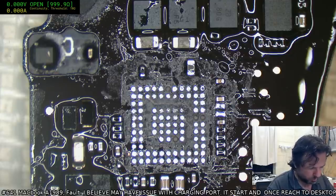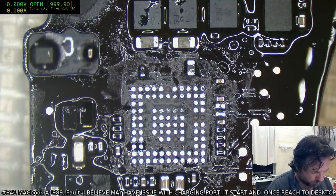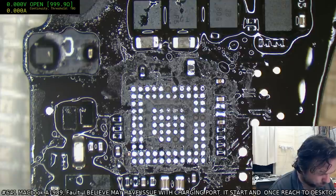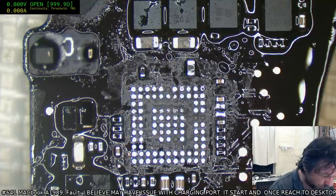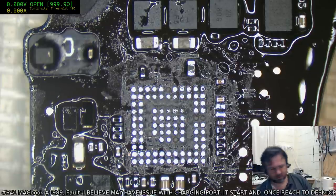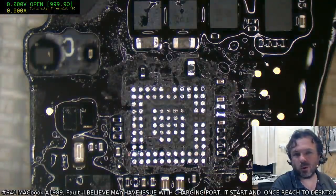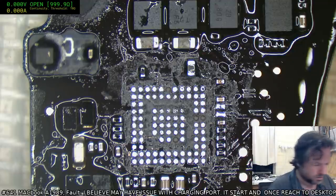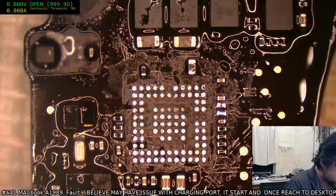That is one of the problems when it comes to working with these chips that all have to work for the board to come to life, is that you don't really know. By the time you get all the ones that are working together, you're not going to take them off and mark them as, okay, these ones are good. You're going to leave them on there. So there isn't really an easy way to test these things. I suppose what you could do is get a board that only has one. Are there any boards that only have one CD3215? Or at least just two, something like a 1708, and proceed to use that as a tester.